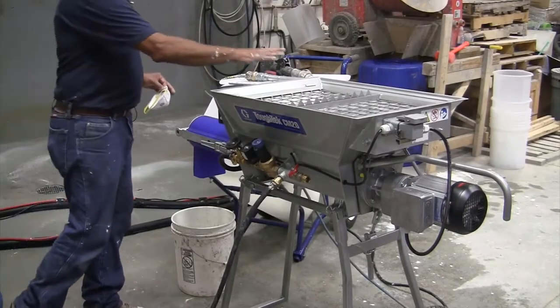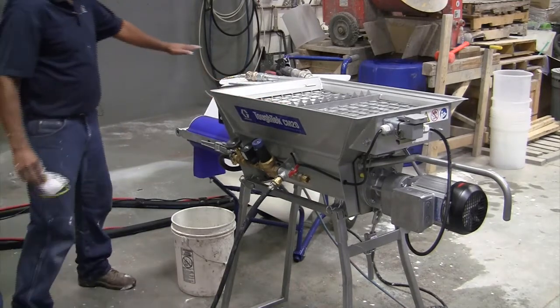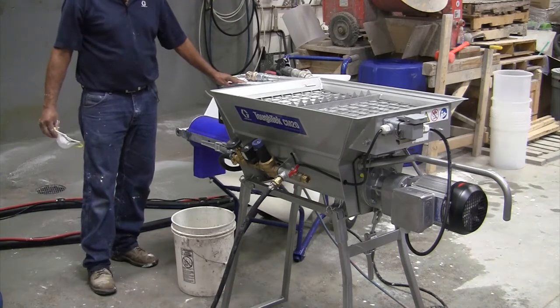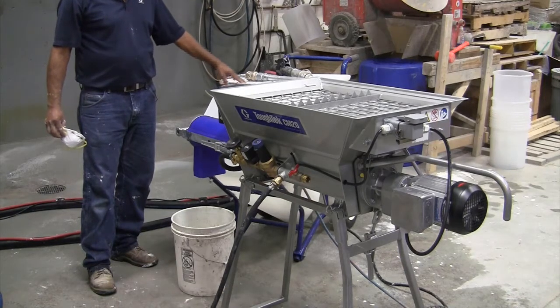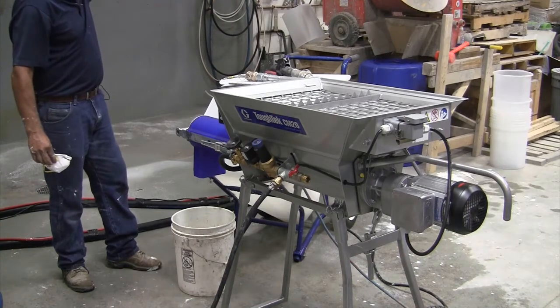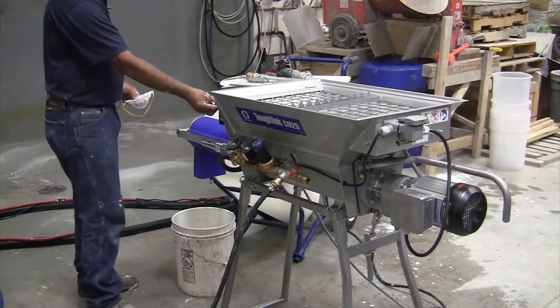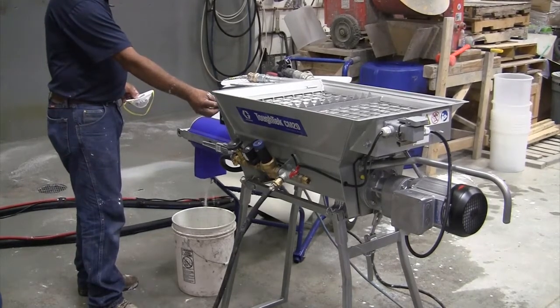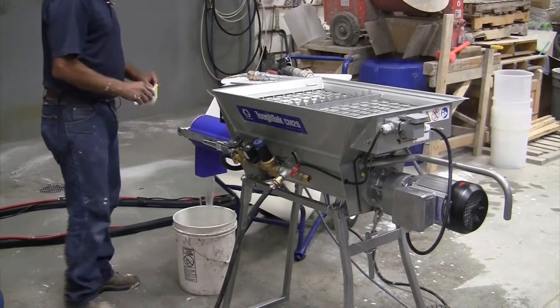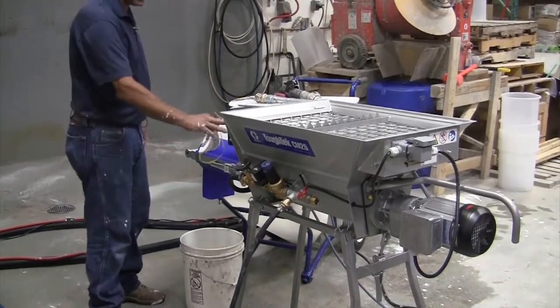This particular mixer has one speed, dialed in to full speed on this stucco pump. This stucco pump has a remote on it — when it's turned on at the nozzle, you'll hear the pump go on. The person loading the bags will turn on the mixer when he hears the gun go off, and when he hears the machine stop, he'll turn the mixer off.